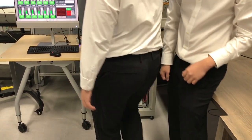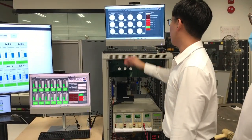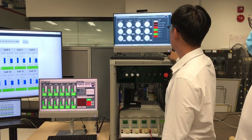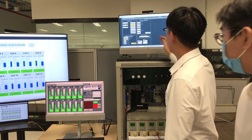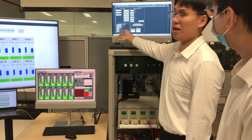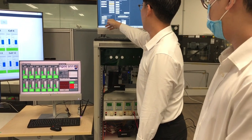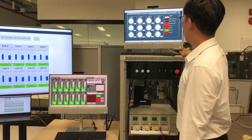This is a 4-channel discharging tool. For the electronic load itself, there are also 4 channels, so you can monitor 4 channels. Currently, we are using only channel 3 to carry out discharge. After you set up everything here, from the discharge current, also the range of the discharging current, and the trigger current, 1 ampere for example, the load starts after the channel starts. After you start, you can conduct the discharge test.